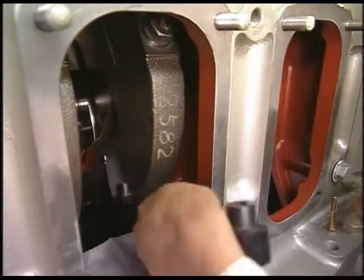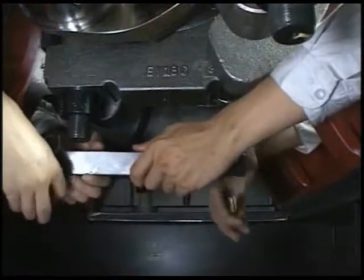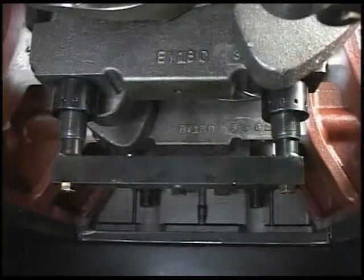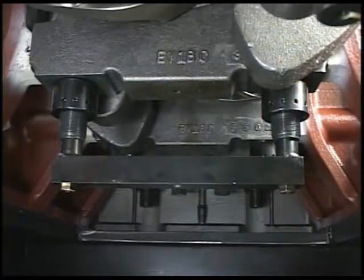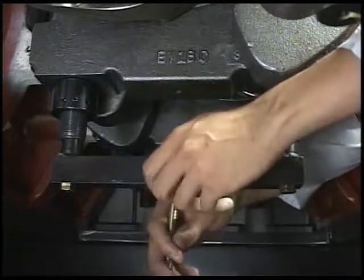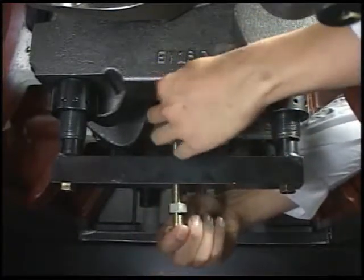After removing the hydraulic jack, loosen the cap nut of the main bearing two or three turns and set the drawing out tool to the main bearing bolt, fixing it with the bolt. Fit the drawing out bolt on the main bearing cap, then turn and draw out the nut.